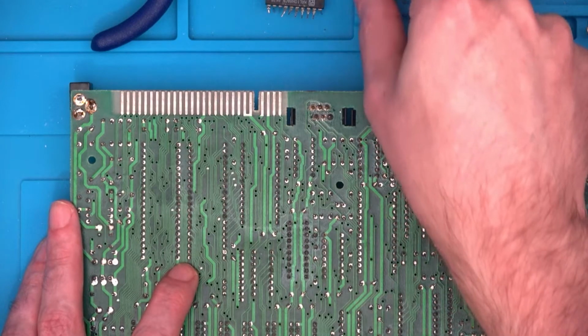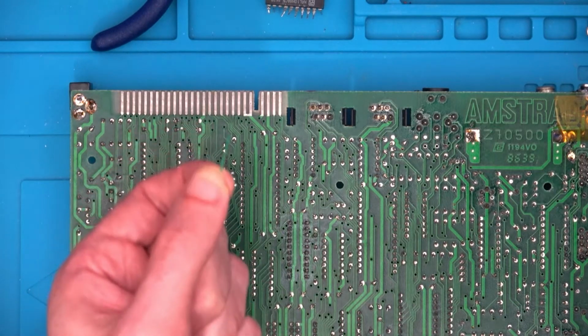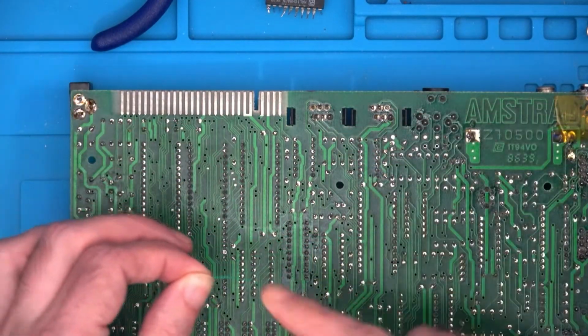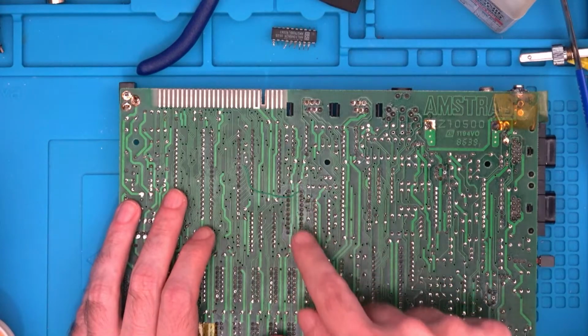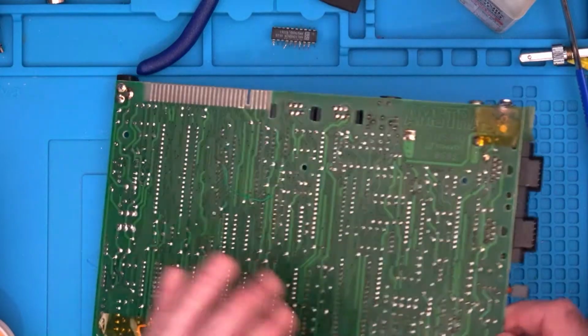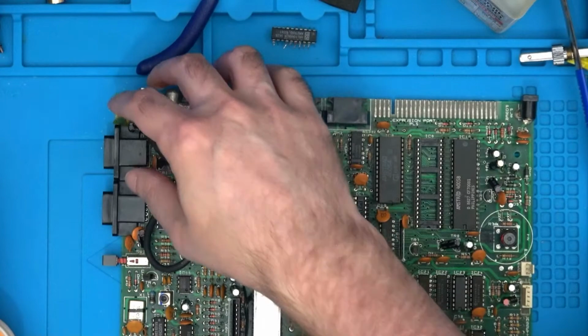and then as you see from the link that I've given, they say they're using a +2 grey, but they're not. I believe they're still using the 128K toast rack type. So we need to cut off the end, measure out the length, and then cut off the end as well, tin it, and then solder it in place. Okay, I'm sure you've seen patch wires done plenty of times. Let's just test that it actually works before cleaning it up and putting a bit of Kapton tape on. So flip it over.